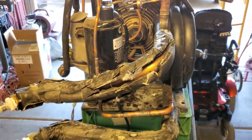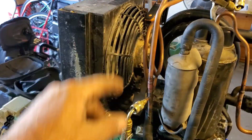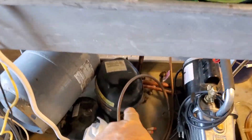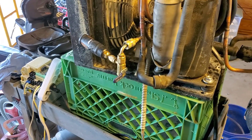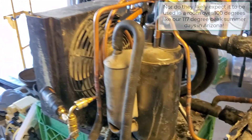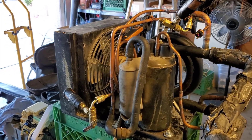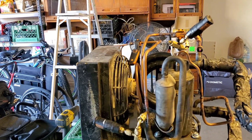That's why they stick these things. I've seen heat pump water heaters, and they stick a little tiny compressor in a coil like this. They use little tiny compressors into a little coil for the evaporator and stick it right on top of the water heater. And the thing is, it's in an indoor room where they never expect it to get down to freezing. We don't get very cold here in Arizona, but we do get into the 40s and into the 30s. It wouldn't be hard if we put a contactor in here on my heating element up there in the tank — two stages.